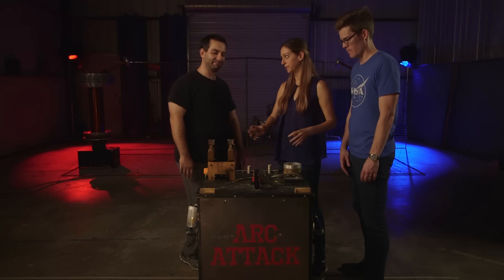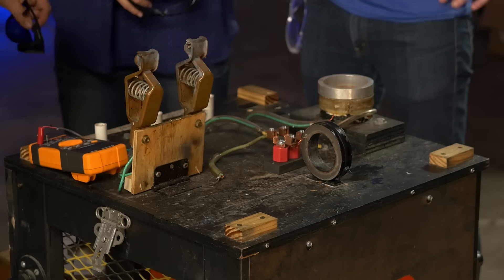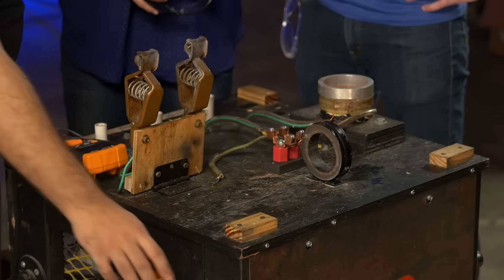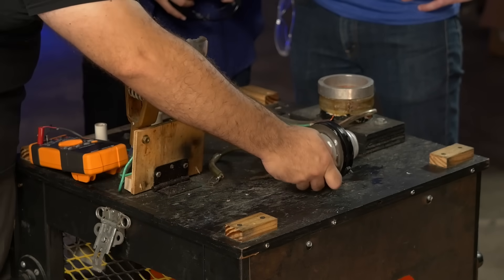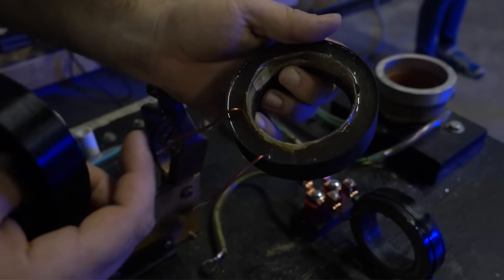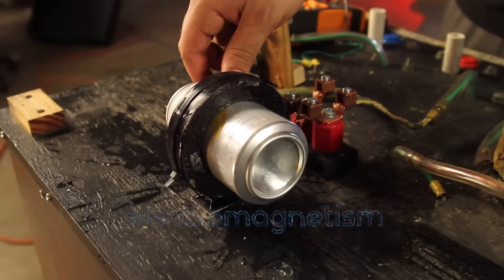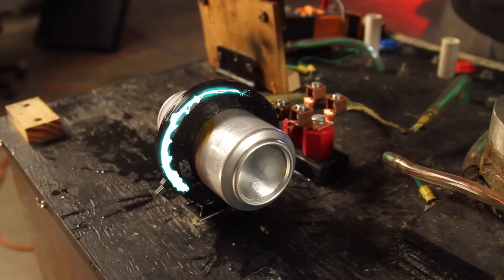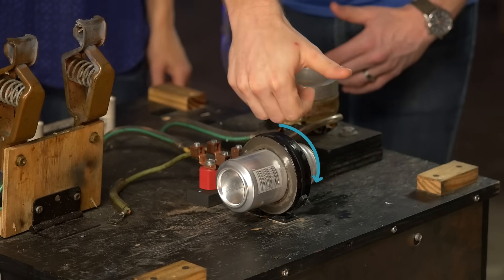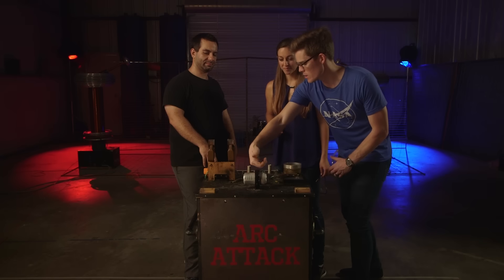So how does this device work? We have a coil of wire right here and we put the aluminum can inside the coil of wire. Then we put an electric current into this coil of wire, which creates a magnetic field. This is one of those weird properties of electromagnetism: an electric current of flowing charges always creates a magnetic field. Which direction is that magnetic field pointing? We talked about this earlier — the right hand rule. So if the current's going this way, then we get a magnetic field all the way around that coil.